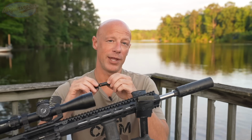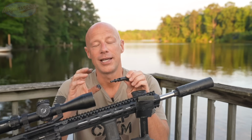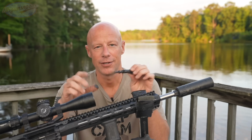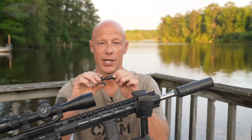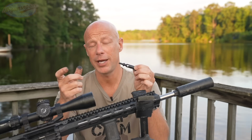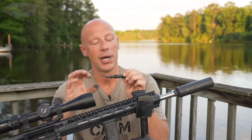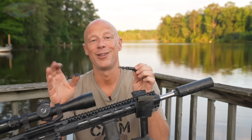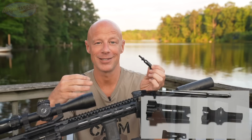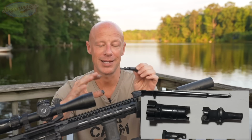Now, the controversy came that when they first were bringing these 9310, you guys, if you read about it on the forums or the internet, you're going to see this. This is why I'm bringing it up. When they were first coming out, what was happening is, again, during that initial rush where these became popular, they were treating 9310 bolts the same way they treated the 158 Carpenter bolts. And they were making them too brittle because the actual heat treatment for that steel is a little bit different. You engineers can talk about it down below in the comment section. But what that was causing was those 9310 bolts to break. And for forever since then, those bolts that were made in that period have been breaking. So if you ever hear reports of that, just check when the bolt was made, and I'd be willing to bet it was made in the early 2010s.